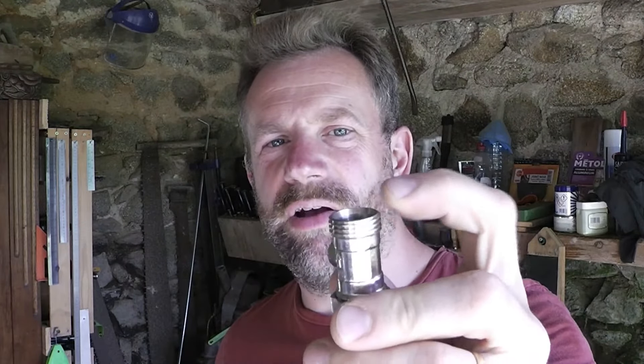The only thing I've found is that probably these flexible ones would be alright because they've got little washers in — you can see. But with the solid adapters, the face on the isolating valve is designed to take a little 15mm olive, just a compression fitting. So it's not particularly well-engineered, and what I've found is that when you put these in at first they leak.